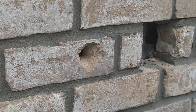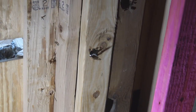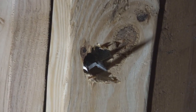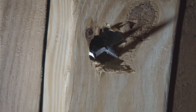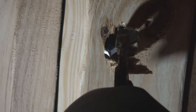So it happened that I got lucky, and had just enough of a drill bit to make it to where I need to, and here it is on the other side. It got stuck in there, so we're just going to grab our channel-lock pliers and pull this out because we got the hole that we need. And now we can run our galvanized pipe straight through here and attach it to this end with the PEX pipe.